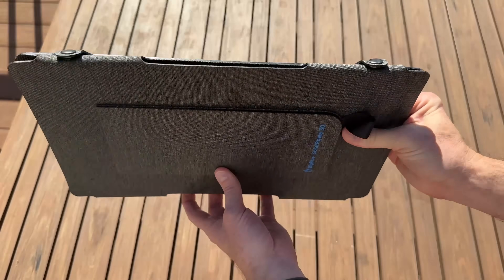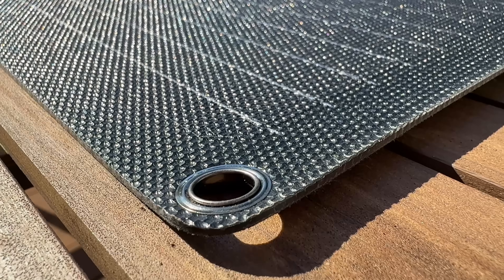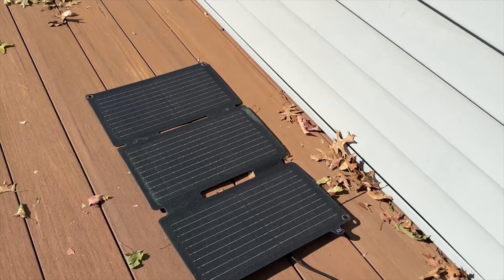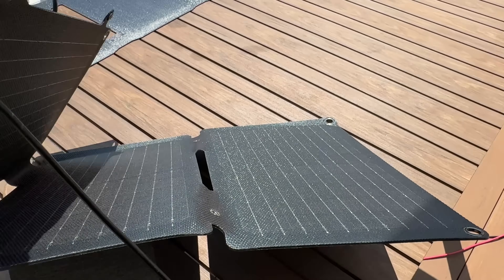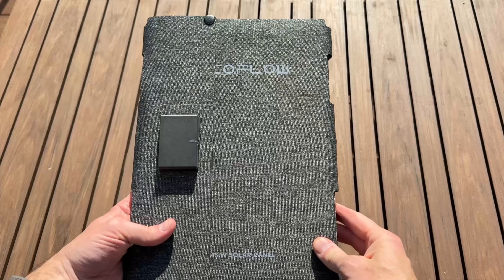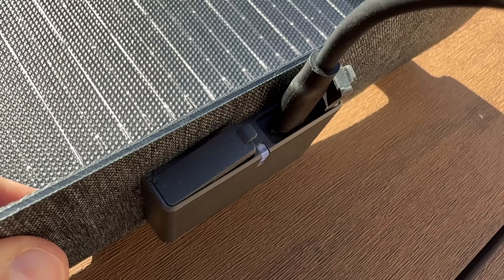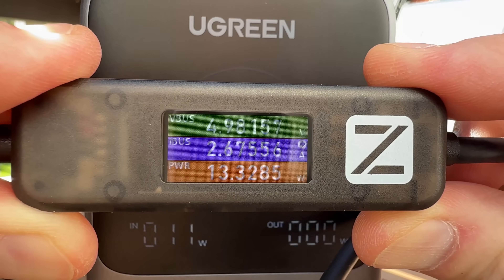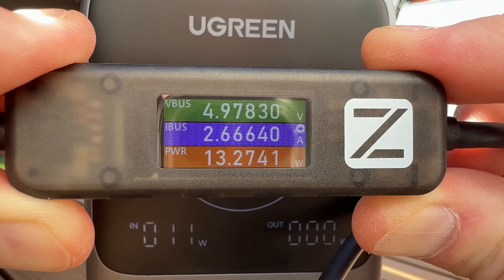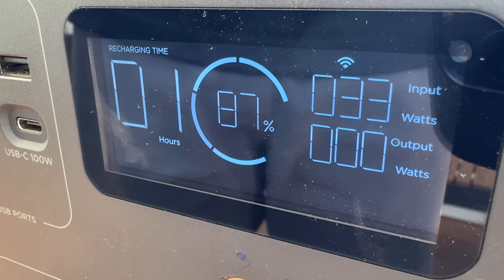The BigBlue 30-watt panel was my top pick for a small solar panel in my previous video. It has three panels, a single kickstand, supports PD 20 watts, and retails for $90. It over-delivered at 23 watts when angled with its kickstand, but only output 18 watts when flat. The single kickstand in the center means this droops quite a bit on the sides, and in the end it just isn't powerful enough to fill the Ugreen in one day. EcoFlow has a new 45-watt folding panel that I was excited to test, but in my tests it only delivered around 13 watts whether flat or angled, well below its 20-watt PD spec. However, the DC output was much better at 36 watts, so it's a solid option for power stations with a solar charge controller.